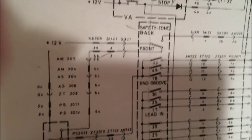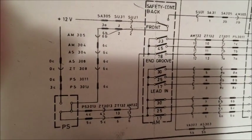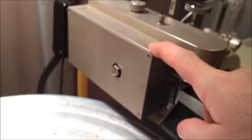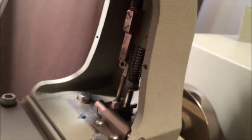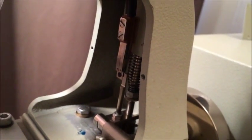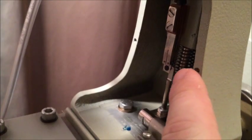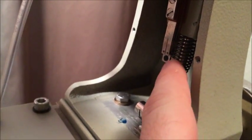I had this problem recently and it really drove me nuts when I found that there's a reed switch inside of the carriage arm, mostly because they replaced a lot of those reed switches with micro switches. There used to be some inside of the suspension box too, but Neumann replaced them in the '74 box and even earlier ones with micro switches. The reed switches were causing problems — in some cases destroying cutter heads. In my case it was just an annoyance, but it took me a long time to track it down.